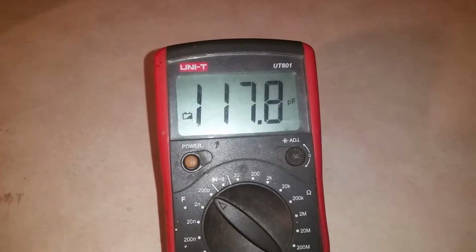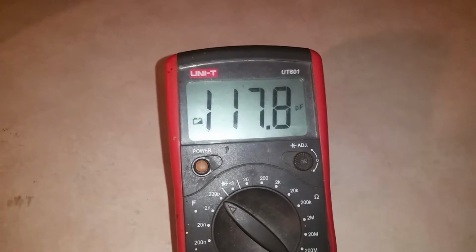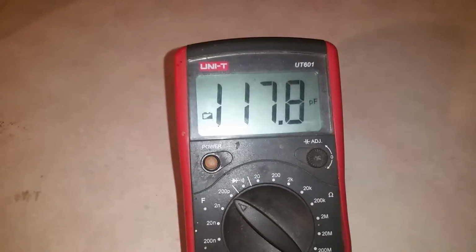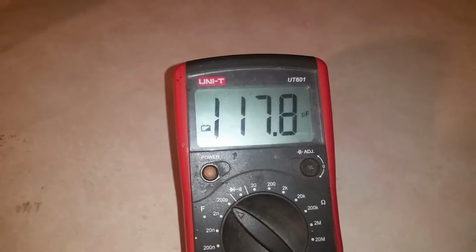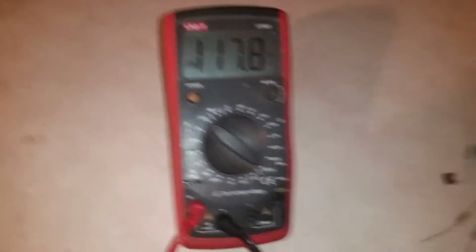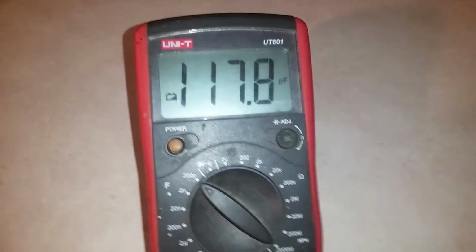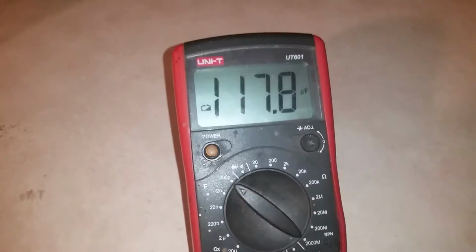And a lot of times it doesn't matter to you. That tolerance doesn't affect you. But I'm a precise cotton picker, and when I go and get my capacitors to build my amps, I've already sat there and spent hours going through a whole bag of 100, 200, 1,000 of these and matching them. Meaning I'll have one bag that all equal 117, I'll have another bag that all equal 118, 120, 121, etc. Which I didn't even have to add in there, but you see what I'm saying.